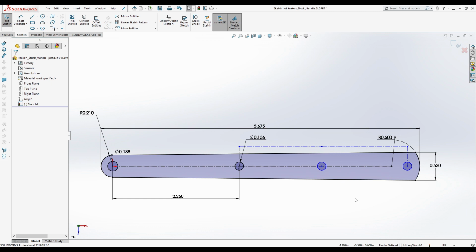When you say a blade shape like this, do you mean a simple one? The tang area itself, because it has flats, is going to make using constraints very easy to recreate it. Okay. That's why. If you have something like the blade shape on a 62, there's a lot more curves, right? And in some cases, there's splines, right? And so it's very hard to use constraints on this.